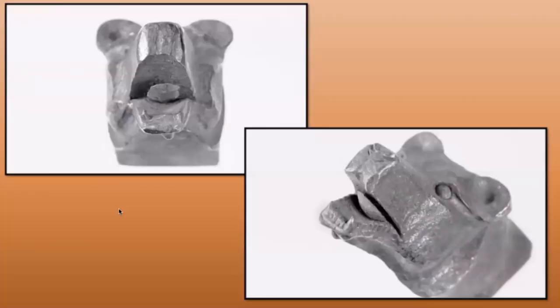Next, we're going to look at the tongue. We are going to come in with a smaller chisel, and this is the only chisel that I have that is actually made of something decent. So I make this out of an air quench steel. Not that I really need the superiority of the alloy, except I want it to be resistant to heat. It's going to be parked in this environment for a long period of time.